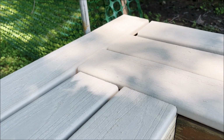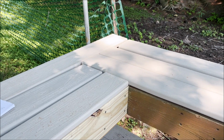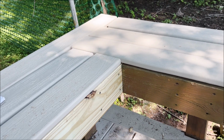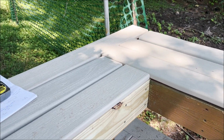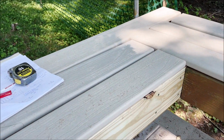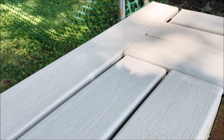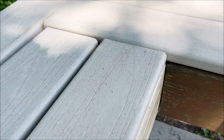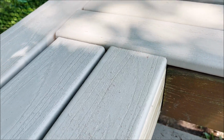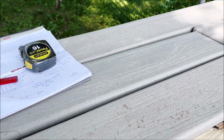I've just been sitting here trying to think of what else I could do, and that's the only thing I can think I can do. I think I'm going to go ahead and tack down that last board going east-west, then tack down this one since the angle's in, and then I'll cut the 2 degree angle on here so that it lines up with that board, and then we'll cut the ends. That'll give us seats right here that are firmly in place.